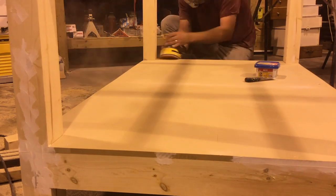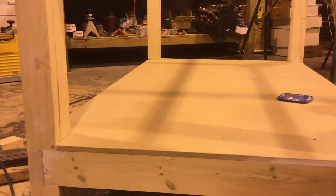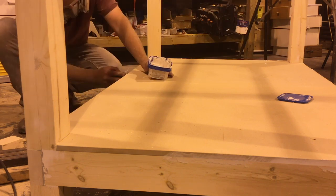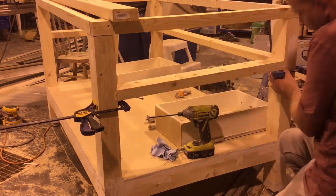I left it a little bit on the big side and then used a router with a flush trim bit to cut it down to size and make sure all the edges were nice and even. Once happy with all the edges and joints, I used a little drywall compound to putty any cracks and fill in the gaps, then did a light sand to smooth everything out.